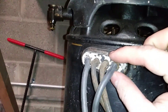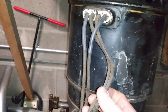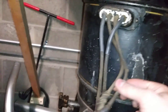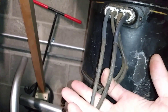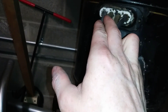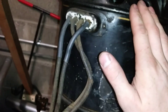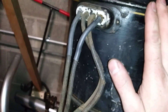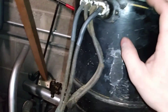On these Century motors you had four wires coming out of a porcelain insulator. Wired for 240 or 208, you'd connect the middle ones together and the outer ones would be your supply. For 120 volt operation, you supply to these two and supply to these two. For 120 volts you're putting the motor windings in parallel; for 240 volts you're putting them in series — either way each winding gets 120 volts.